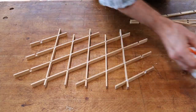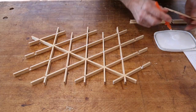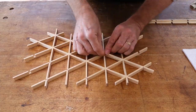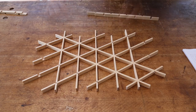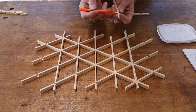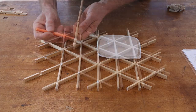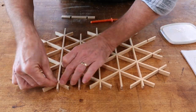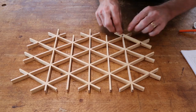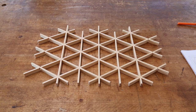Inserting the top Kumiko is no different. With the various tensions on the Kumiko some joints may feel tight, so rather than pushing them in with your fingers use a hammer and tapping block to avoid hearing that horrible snapping sound. That's the Jigumi done. We now have to let that dry thoroughly before cutting the Jigumi to size. I normally make up the triangles while waiting for the glue to dry, but I'll cover that part later.